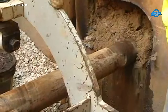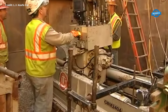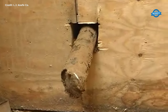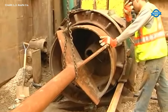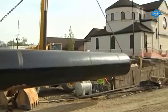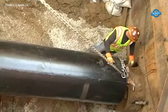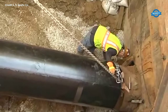The process begins with the hydraulically powered guided boring machine advancing the pilot tubes while displacing surrounding soil. Continuous monitoring of line and grade is achieved through a theodolite optical guidance system. Operators meticulously steer the GBM to ensure horizontal and vertical alignment by observing the advancement on a monitoring screen and making necessary adjustments for accurate arrival at the receiving pit. The versatility of the GBM allows it to navigate through various soil types, including clay, sand, and small gravel, owing to the steering head attached to the lead pilot.